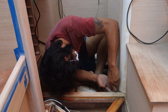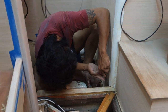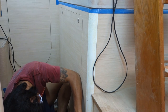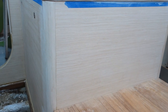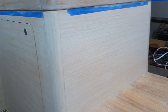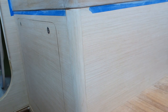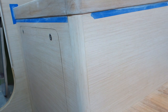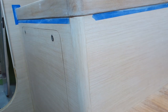The final bit of floor which has been taken up is where Tui is now sitting. The job Tui is doing is making this rounded area here ready to receive its piece of veneer. The carpenters have been getting to grips with the final piece of work on the engine — he had to curve the corner and then put the veneer over the top. The veneer has gone on vertical because you can't curve horizontal veneer without cracking it. The curve looks great, and now Tongjan and Deng can get on with varnishing this whole area.